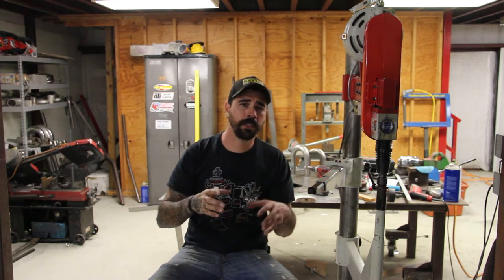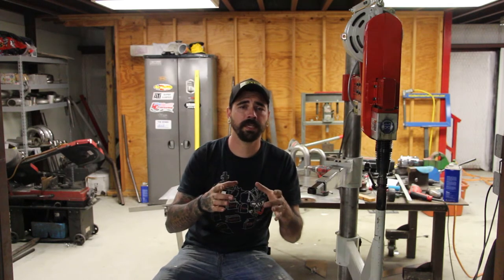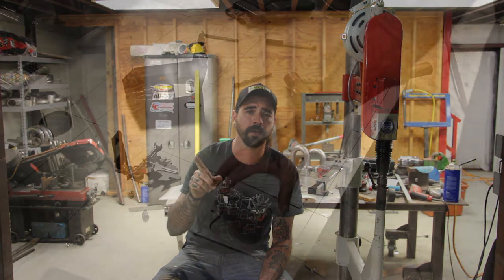Today I'm going to work with stamping sheet metal — this is one of my favorite things to do with this machine. I will make what's similar to a hammer form out of plate steel, and we use the reverse curved dies and the mini dies to stamp that shape into the sheet metal. This can be used for many different applications; I've used it for firewalls, for corrugations and floor pans, all kinds of stuff. Today I'm making a piece that will be a pass-through for a roll cage on a 69 Camaro firewall.